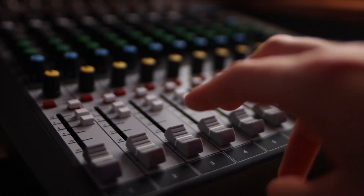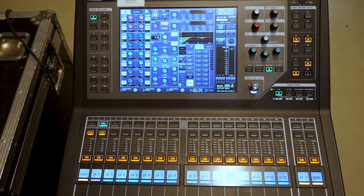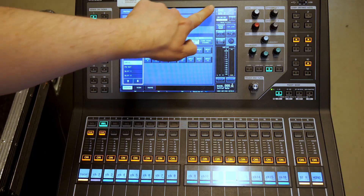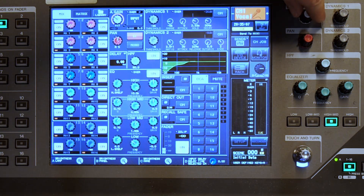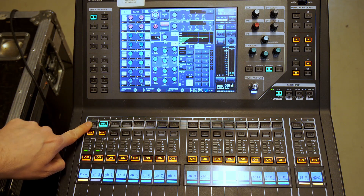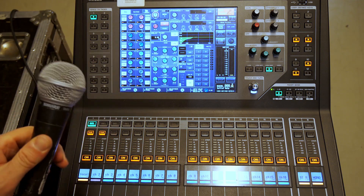If you're using an analog mixer with analog splits, you don't need to think about digital gain because you're always using a separate preamp with a different line going in. But if you're using a digital mixer, you unlock possibilities like selecting a second channel and having it mirror the first channel. Now you've got the same channel on two inputs, but the problem is that the gains mirror each other — because they are only using one microphone preamp.